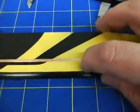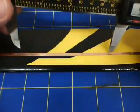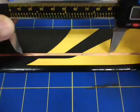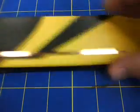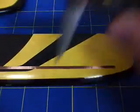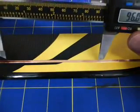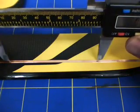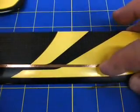So now I'm going to start with that first mark. Set my calipers on that and I'll make another mark. So there and there is where my first two green LEDs are going to go on the top side of this blade. Come over to this blade again — calipers still set. Here's my first mark. Set it on there and scribe a mark.